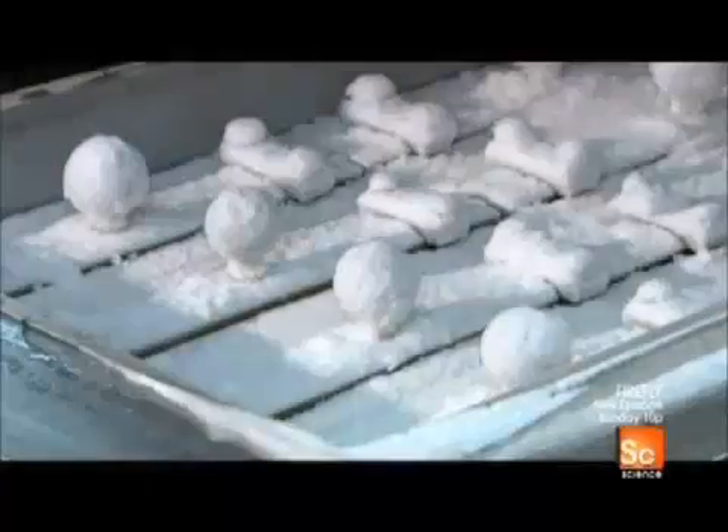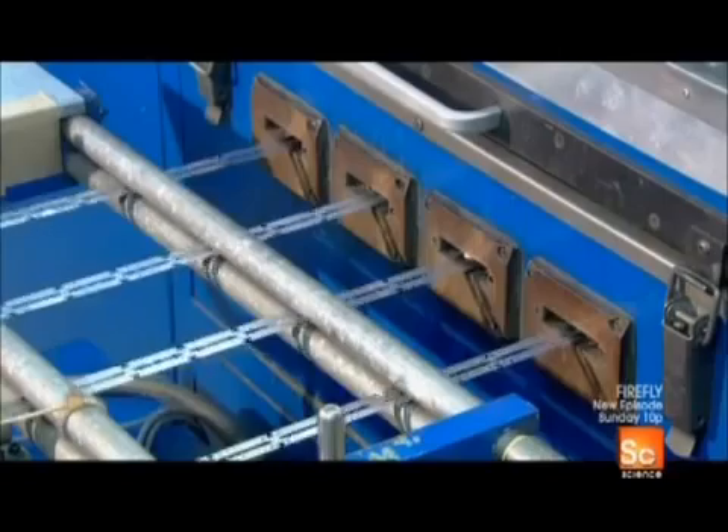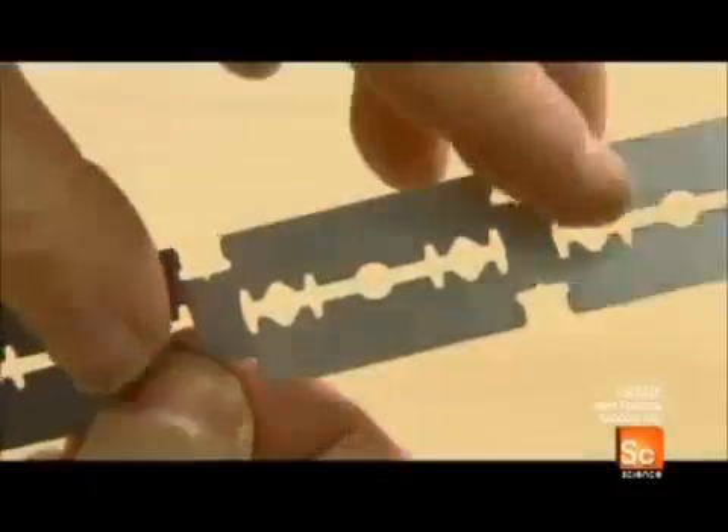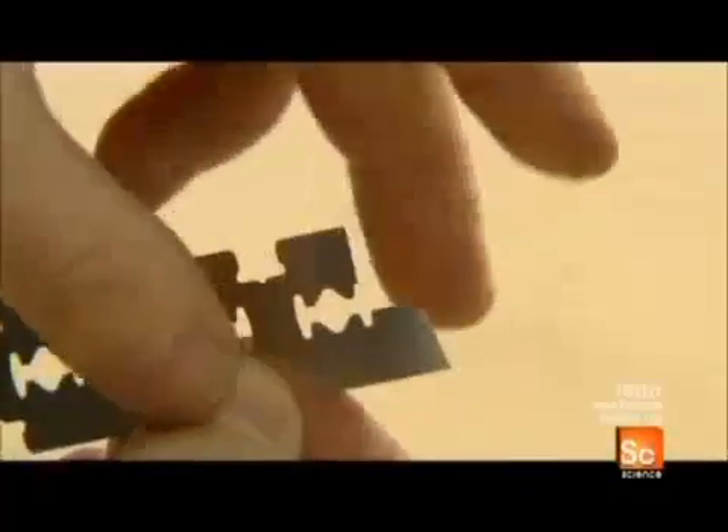Step three: they chill them for about twenty seconds in a deep cooling chamber at a temperature of minus fifty-eight degrees Fahrenheit. All this progressively restructures the molecules, hardening the metal. However, the metal becomes brittle, necessitating reheating the blanks for twenty seconds.